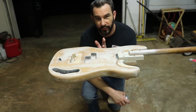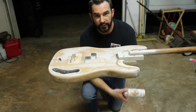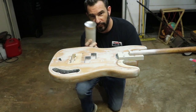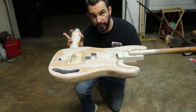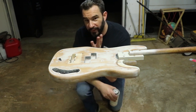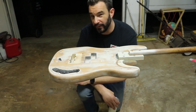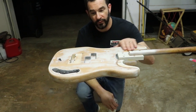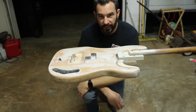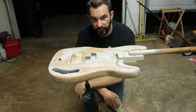It's the next night. I've got four or five coats of sanding sealer back on the guitar. You can already see some issues with some low spots. So I'm going to finish off this can of Olympic white — at least four coats. I'm going to wet sand again. Hopefully I don't have to use any more sanding sealer, though I've probably got about two or three coats left in the can. The white will help me see the surface leveling issues way better than the finish that's on here right now.